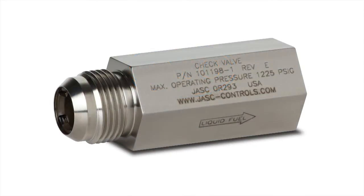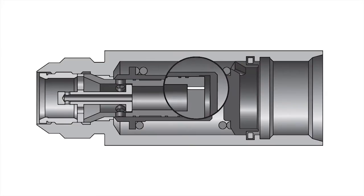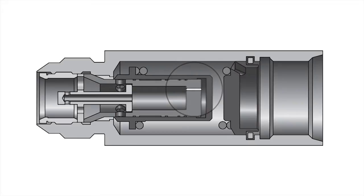The Jask liquid fuel check valve is revolutionary in industrial check valve design because it uses a Helmholtz resonator and an inverted spool. The unique attenuation feature in the Jask liquid fuel design provides fluid damping. This feature results in stable valve operation from crack to full flow. The resonator dampens the effect of fuel pressure imbalances so when the valve cracks open, it stays open because it is able to modulate the pressure imbalances.